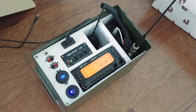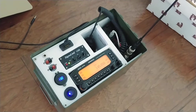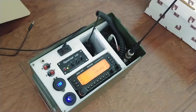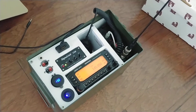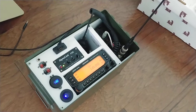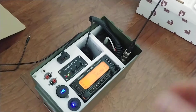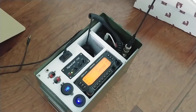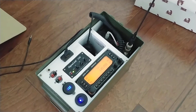It's currently running on battery power through the Signalink device. It's set up on VARA at 9600 through the Signalink, but you can still run it at 1200 baud using that setup. You can set it up for 9600 and it will work just fine for packet 1200 as well as VARA narrow. Right now I'm just using an HT whip antenna, the radio is set to low power which is 5 watts out — the HT whip antenna can support 10 watts max so there's no issues there.